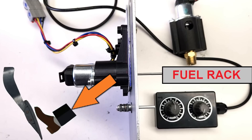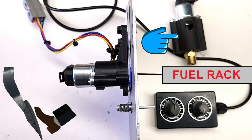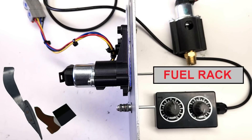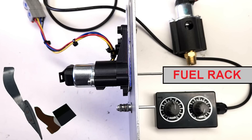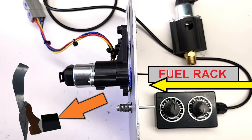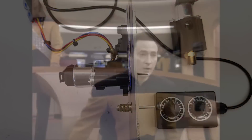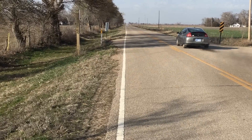When the accelerator is pressed, the first thing that happens is the boost controller closes and provides maximum boost — lean burning diesel engines love boost and this won't hurt a thing. The governor will immediately want to shove the fuel rack forward, but for a moment we'll block the fuel rack from moving. Then we'll start retracting the fuel rack limiter and the engine will start feeding on more fuel. This should theoretically eliminate most or all of the smoke generated when the throttle is first depressed. If the acceleration event is normal like in urban traffic, the software will track engine speed, vehicle speed, and manipulate both the fuel rack and the boost accordingly — it may actually pull back on fuel or boost as the car travels at a moderate pace. In the event the computer sees a full throttle signal from the throttle position sensor, we'll let the engine feed on all the boost and all the fuel it wants — when the captain calls for warp factor 9, there's no debate. We just make it happen.